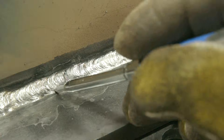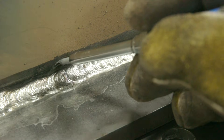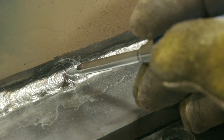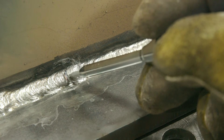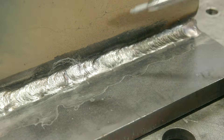Right here is the tie-in — it's a pretty good tie-in. Having that crater there allowed me to fill metal on top of it and lap it in without a cold lap, burn into it, and just continue on. Let's go ahead and throw this up in the vertical position and do it again.